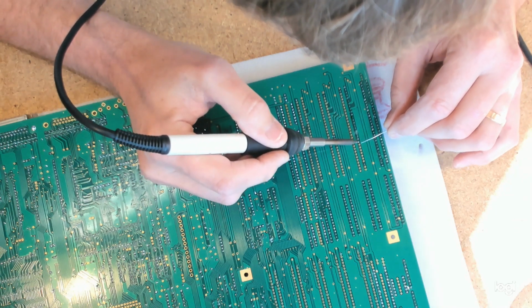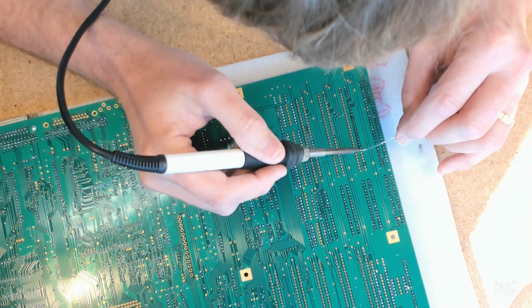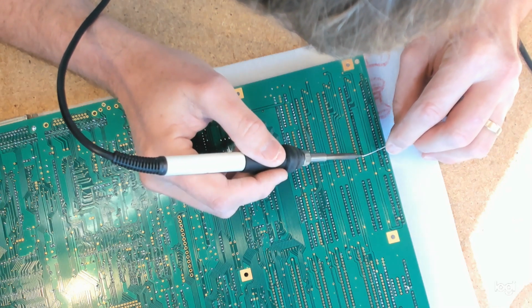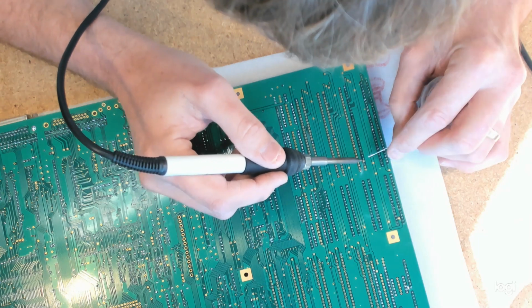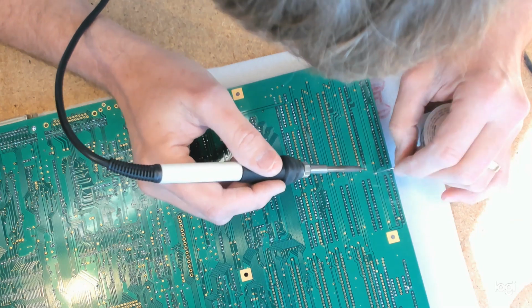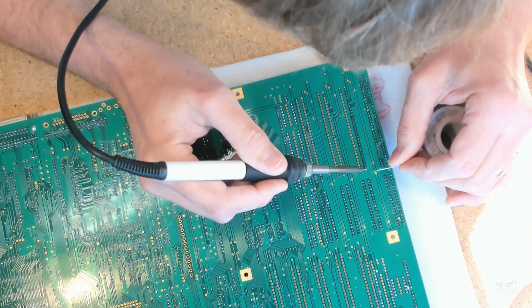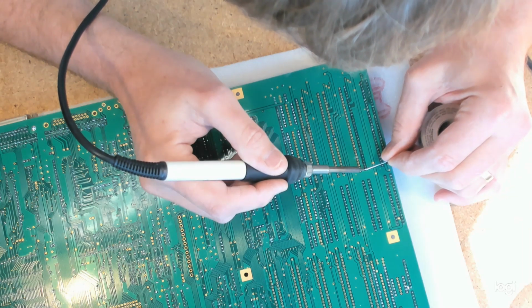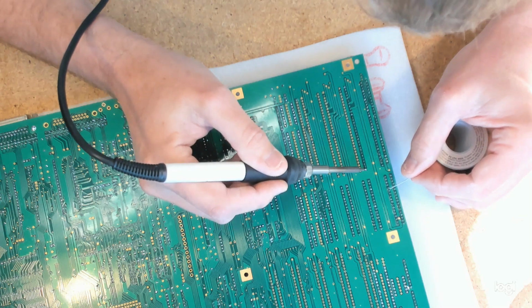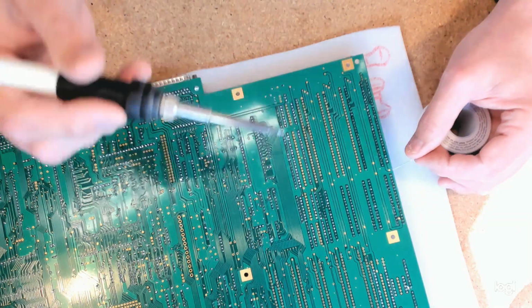And so, you know, I've even tried soldering left-handed and had a decent result. Just knowing, you know, having a bit of confidence with solder wick if things go wrong. Here we go, got a fat one again. A little bit of solder on the iron just to help wick in the heat, and then right in deep down low near the board with the flux, and then a nice long dwell time. The kind of dwell time I would not have been confident with not all that long ago.